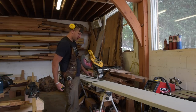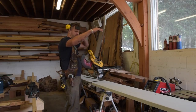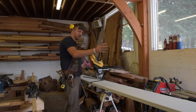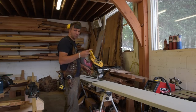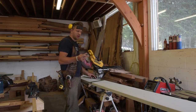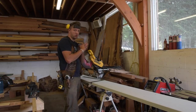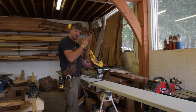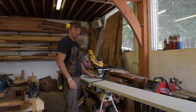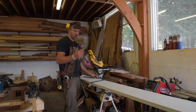So this fascia is going to be going along the side of the deck where there is a slope on the deck. So I have to adjust that, cut an inch taper in this, then cut it to length, miter one end, put it up. I'm gluing all my joints with PL Premium. That's the high grade construction adhesive that gives you a nice good working time, and it really holds and never comes apart and will keep your joints from warping when the sun hits them. It holds those corners together beautifully. That and 3-inch screws and trim head screws anywhere you can hide them.